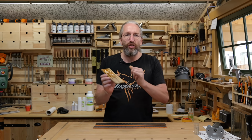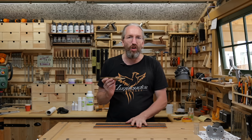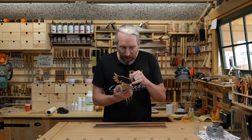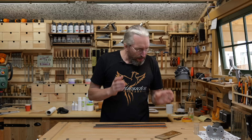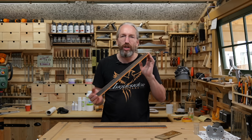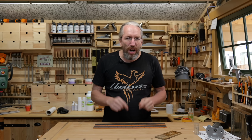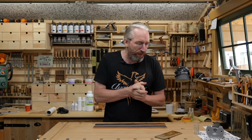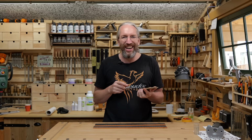Yeah, I cleaned the workbench for now, and while the resin is still curing, I am confident enough to start routing the cavities on the actual two fretboards, because I can identify on our practice piece where the areas of the inlay are that I need to take a bit more care when routing. And I think by identifying those problem areas and now going to route in a harder material, in some areas it's more difficult to route in the ebony because it's harder. And on the other hand, this might help me to get it nice and tight, even curves. By doing this practice piece, I'm now confident enough to start routing in the actual fretboard.